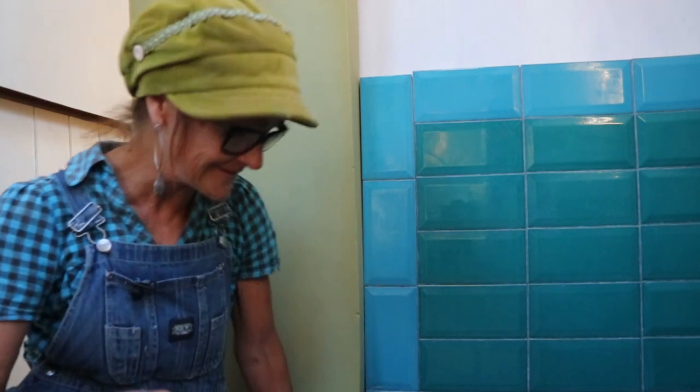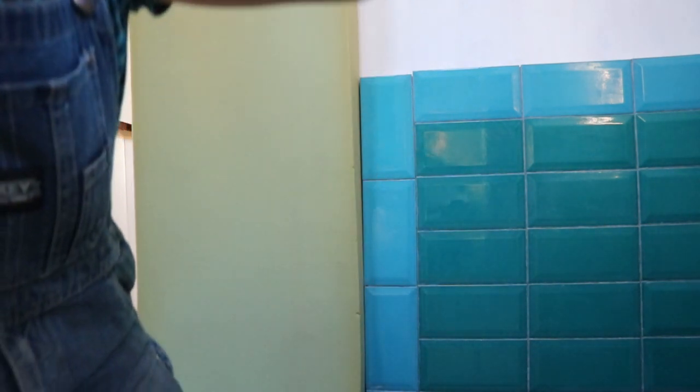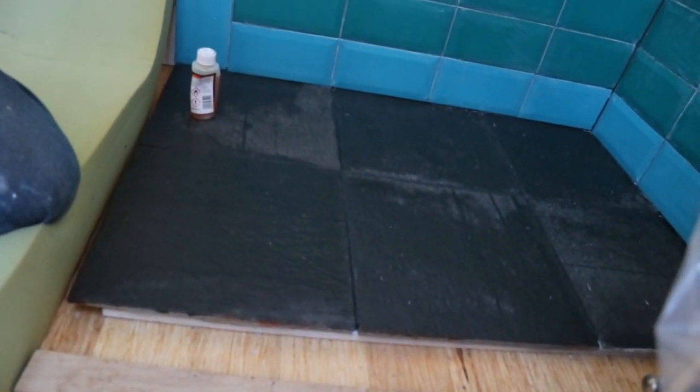This is my last job for the week. I'm sitting on a bit of foam because the sound quality was terrible filming into tiles - it's just bouncing around. I've done all the tiles, grouted them, and I'm doing that usual thing of cleaning them a million times to try to get the smearing off, but it's nearly there and they look nice. I've just finished dressing the slates with slate dress oil, which smells lovely like linseed oil - it's brought them up really shiny. All that white bloom has disappeared.